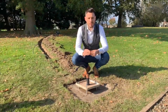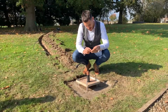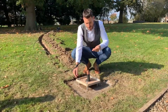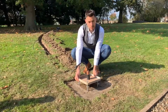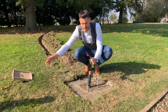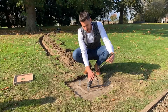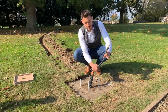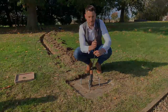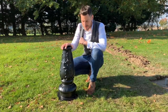We've now come out the following day — the foundation is sufficiently hardened. We've removed the tape applied to our threads, removed the nuts, and it's now time to remove the ply template. We've also removed the taped end on our ducting and threaded through our armoured cable, which has a glanded end.